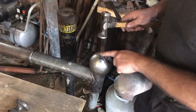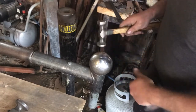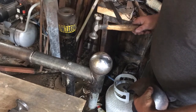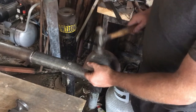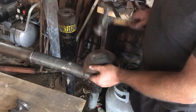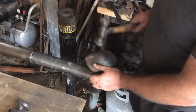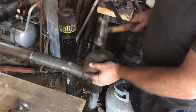Our goal is to hit the flat part of the steel with the flat part of your hammer — just like that. You hear that sound? We don't want to have different sounds or inconsistent strikes. That consistent sound is what we want.